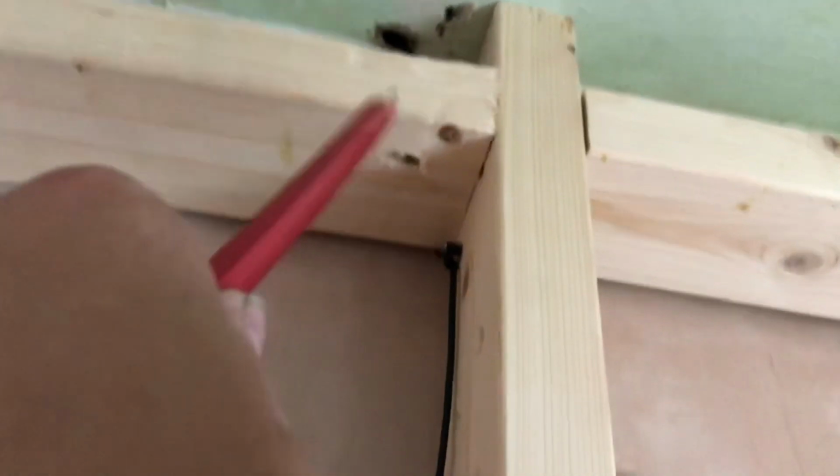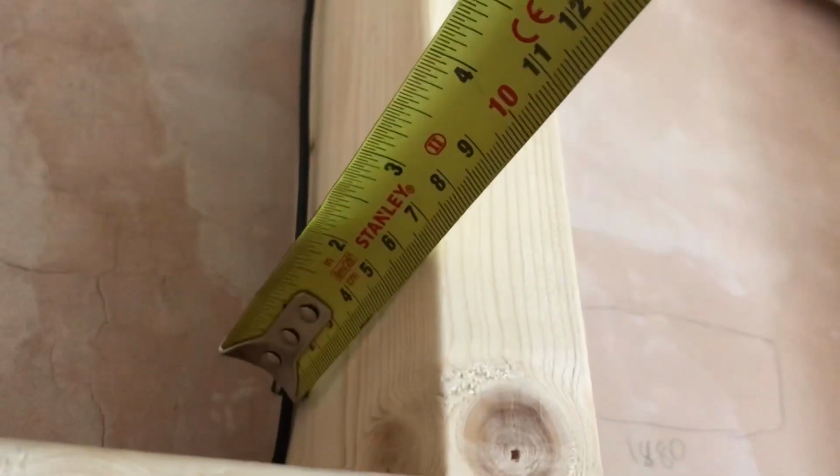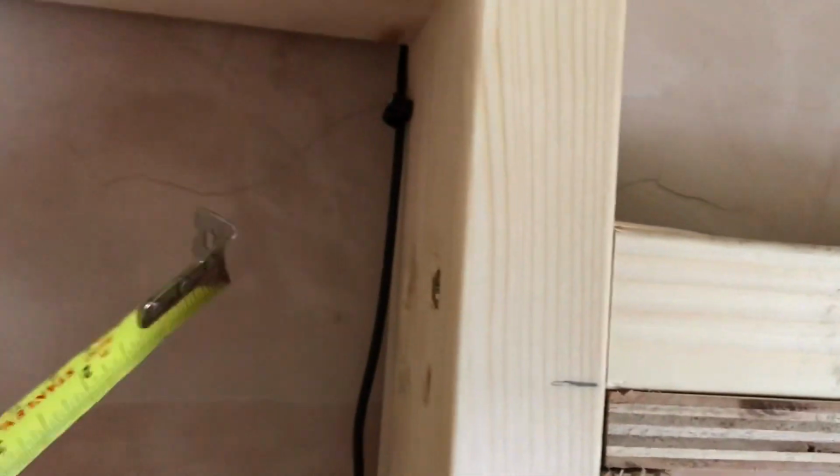Okay, here's where we're at. Little cable goes up through the ceiling, is clipped on the inside of this timber, which, by the time he's got ply and tiles on that, you're looking at 4 inches. Okay, so that comes down here, and then probably leave a coil of the lead here